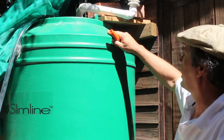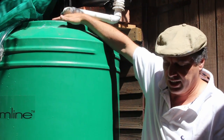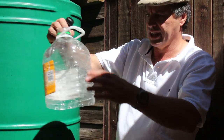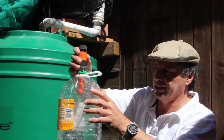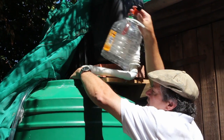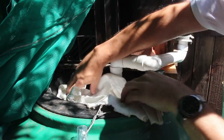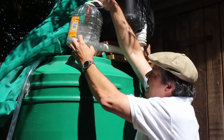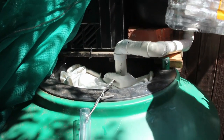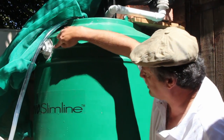I particularly like this size Jojo tank. I like that it's got this recessed lid, and it comes with a wire mesh. All you need to do is get maybe a 5-litre used container, get your spray nozzle through here, and attach it so that the water spray is inside here. Adjust this above the mesh. With this recess here, you take cloth and put some HTH on top. You lay it on top of this cloth and let the water spray through the HTH, through this cloth. Then the water will drip down, go all the way to the bottom, and let it fill up to the outlet here.